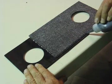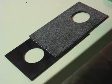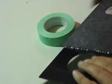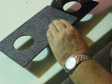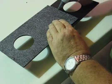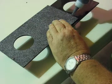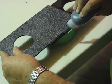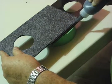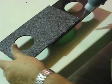Then I cut a two and a half inch hole in one end of each piece. Using the ABS resin, I then bonded the two pieces together. The product is a liquid ABS resin — there are no catalysts or hardeners, nothing to mix. You use the resin straight from the bottle and let it air cure for 24 hours. If you passed scissors and glue in kindergarten, you have the skills to repair damaged plastic.